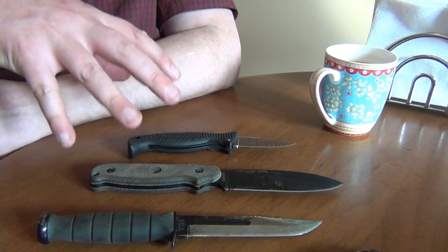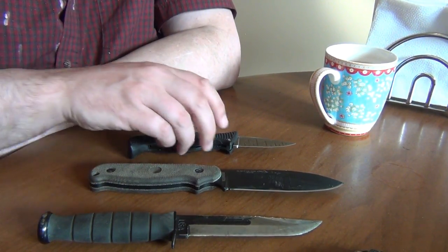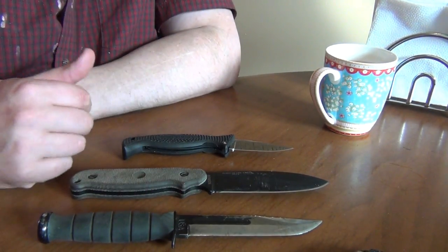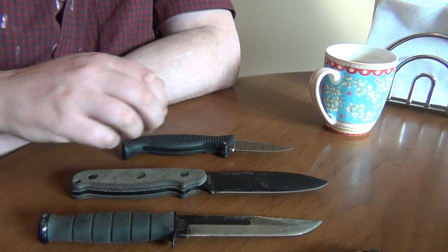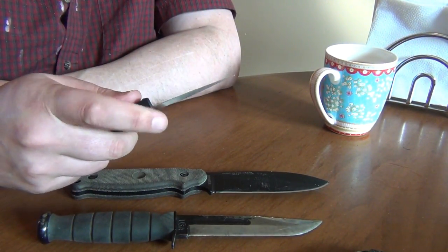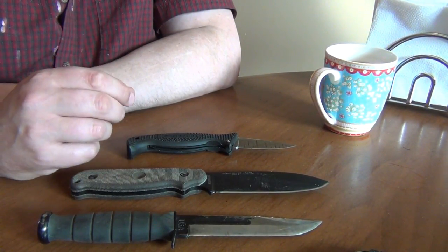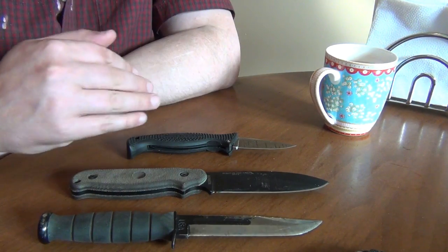These are three similar knives in that they're not geared toward really low-stress cutting. They have relatively thick blade stock, especially for the shorter blades, so there's a fair bit of design scope for prying-type work or heavier cutting where you're doing twisting and poking. You don't make a blade that thick for cutting paper and soft foods. The knives were kept very close to their as-boxed configuration, so the edge thickness and edge angle were very similar to the actual new knives — it didn't change them.